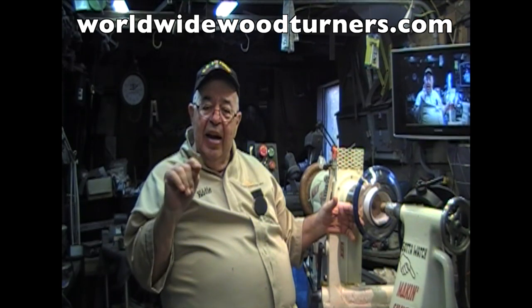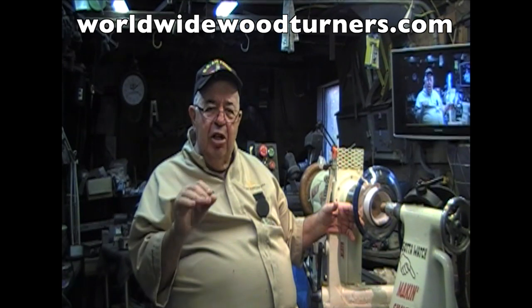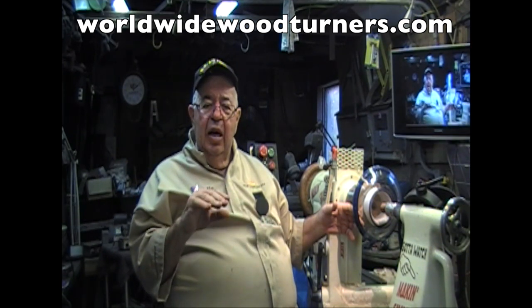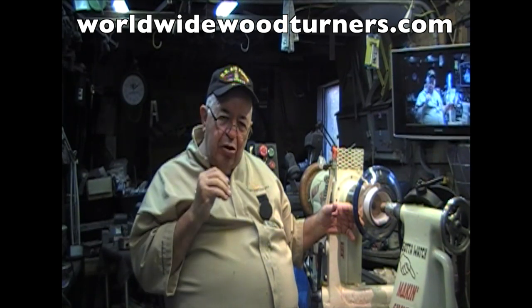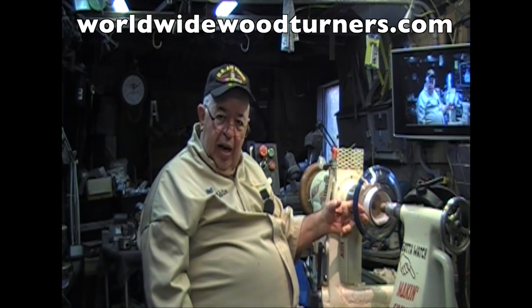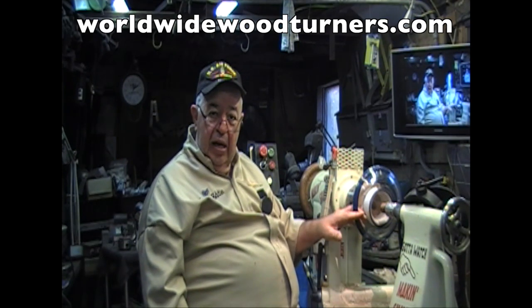Remember, the light has to pass through the cover, the coating, the finish, or anything else. The light must pass through that in order for you to get the chatoyance, the beauty, the cat's eye of the wood. It has to pass through your finish. This one has no finish. So a scratch on the inside will be seen from the outside, so I'm going to get rid of the scratches on the inside and the outside.